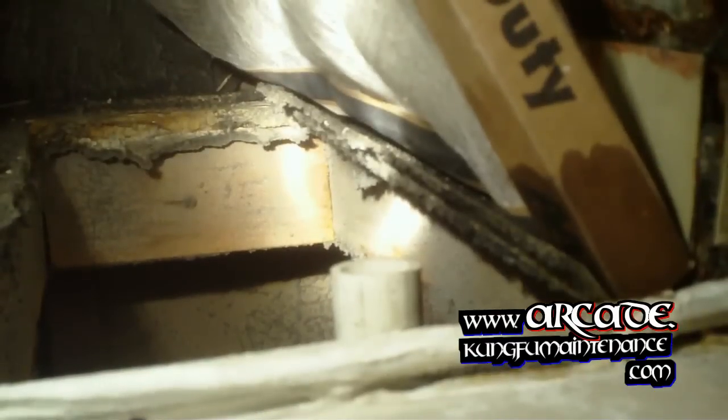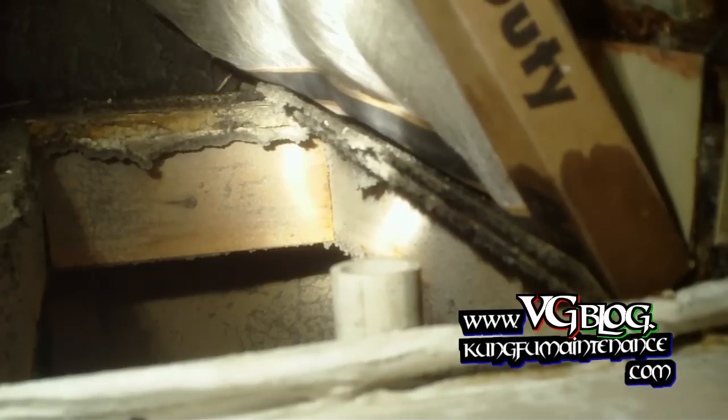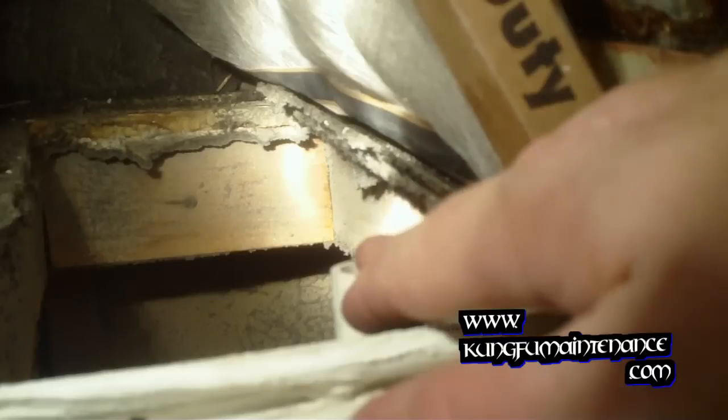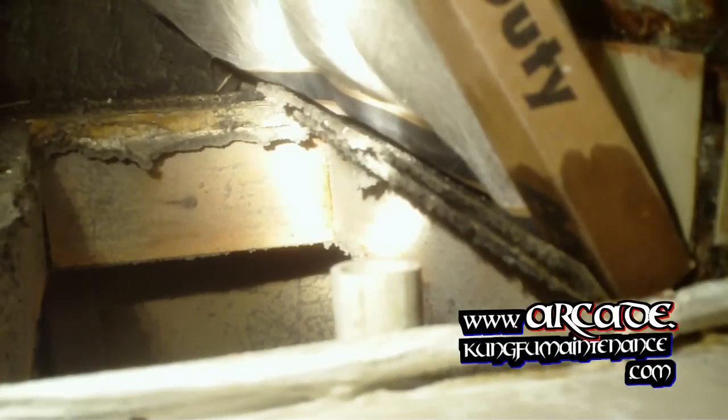So when we have a leak like this, it's not just water — it's actually treated water with anti-mold, anti-fungal, anti-coagulant. And it also keeps odors away. These drains work via gravity just like normal drains, so it drains to a well out back where the level is lower than it is here at the drain pan and at the vent. Sometimes if I hook up my wet-dry vacuum from here, I may need to cover the vent. I usually use these little laminated tags — I'll fold that and put it over the hole and that makes a really good seal.